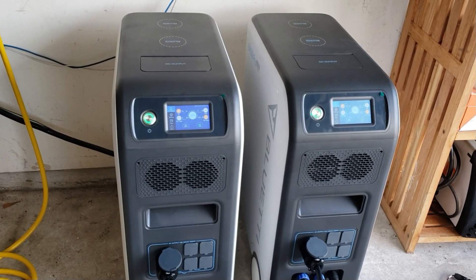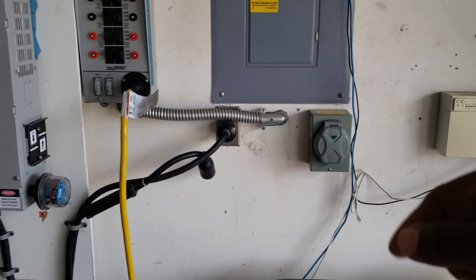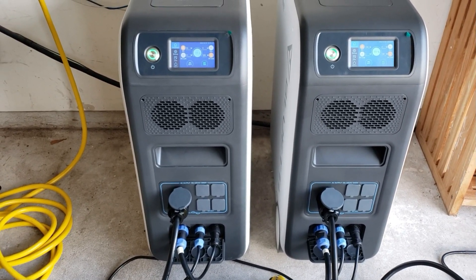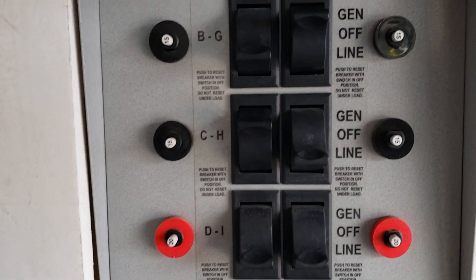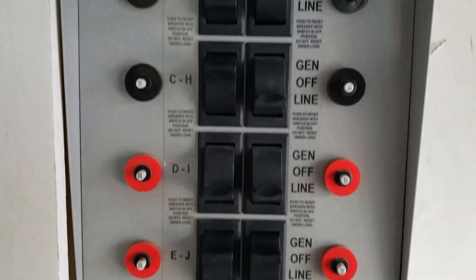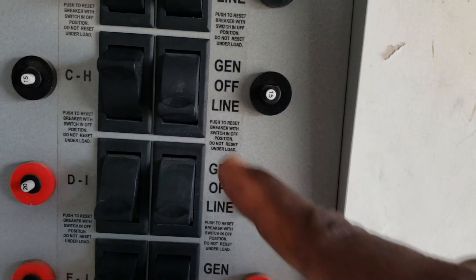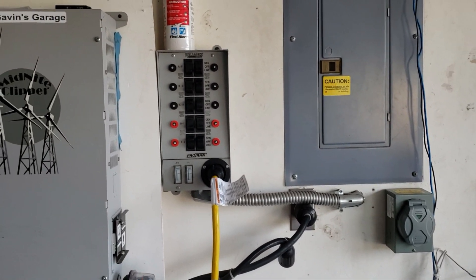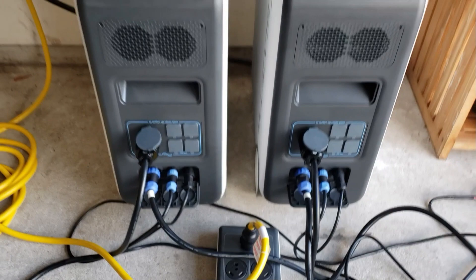First thing I'm gonna do is just kind of run a little test. Let me show you the setup I have. Like I said, it's connected to my transfer switch instead of my inlet box. This does have 240 volts, but because I don't want to power the AC or any large loads, just my essential loads — like my septic, fridge, kitchen, microwave, guest bedroom, heater, living room, detached garage, gate, garage doors, and the master bedroom and bath. So it's gonna be powering all those 120 volt loads, and it's able to do that with the split phase, so you can power two legs.